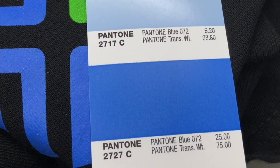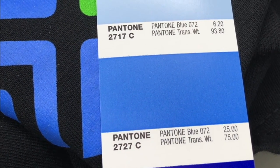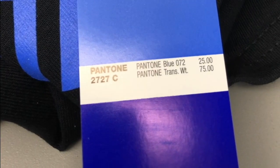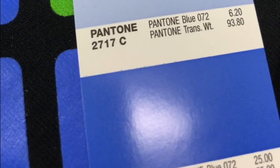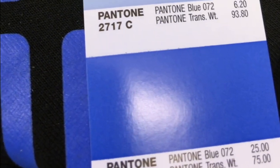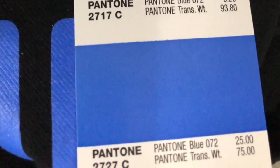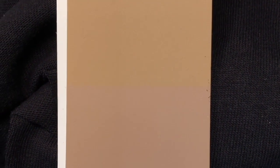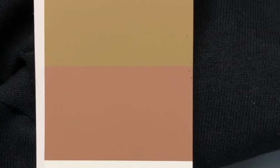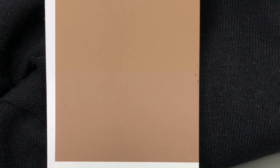As you can see, when we change light sources in the light box to UV and to commercial lighting, you can see a slight shift. This has to be communicated to your customer that we use D65 — a lot of people call it daylight — so they can see what color we're going to hit. Some colors are more metameric than others. Here's a metameric page out of your Pantone book — you'll find it in the back. Here I'm changing different light sources and you can see slight shifts. If you or your customer is looking under the wrong light, a metameric color can look very off.